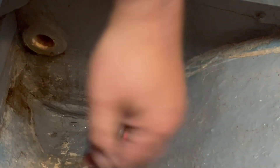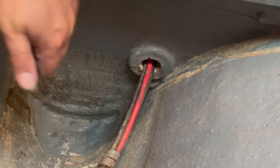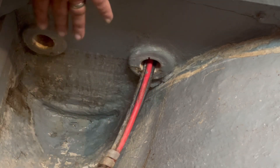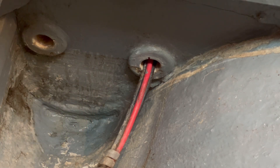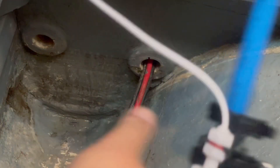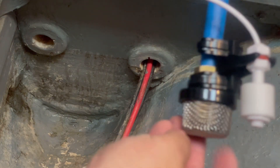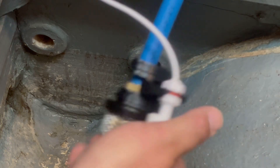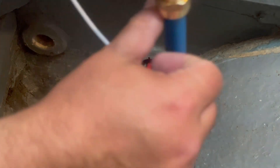The raw water or green water hose that was sticking out through here is what used to provide water for the old toilet. Now that we've pulled that hose back we actually have a conduit in which we can run our shower drain hose. We have assembled the apparatus without the upper float sensor — I'll do that once it's fully installed — but here you can see the strainer assembly and the float switch all set up. Now we just need to get it run through the bulkhead.